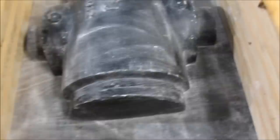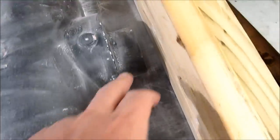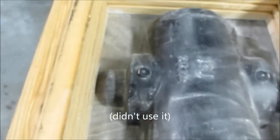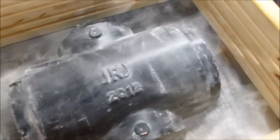Now I've got it set in the drag, getting myself a couple inches — an inch and a half or so all the way around. Now what you see here for my form, these are called core pockets. The aluminum won't come this far if everything works the way it's supposed to. This is the edge of the actual casting right here. I've got a core that I made. I tried to videotape that but it didn't work out too well. It'll fit inside these pockets so the casting will be hollow when it's all done.